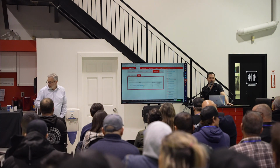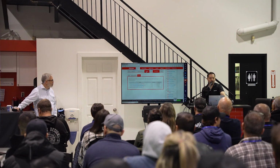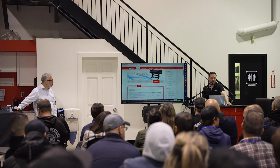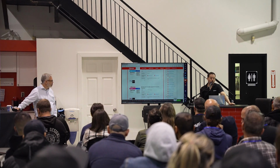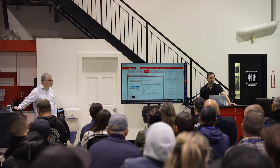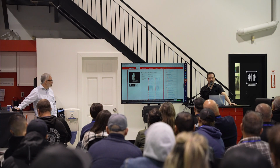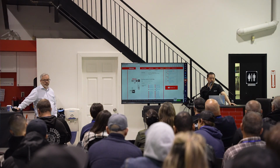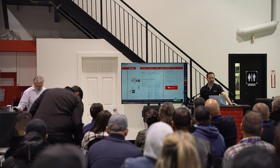Just to touch on Mimaki.com as well, I've got my download section, and I've also got a supply section. If I'm under my machine, which I've clicked on the left, I have a supply section. It takes me to part numbers and what is meant for this machine. If I'm wondering which cleaning liquid I need, you can come here and we've got maintenance liquid. It takes you right to it. So this is the cleaning liquid, the ones we showed you, that you put into the caps to clean around the print head. And we've got a cartridge, which sits on the outside, which will run empty and give you a little message, so you can order that.